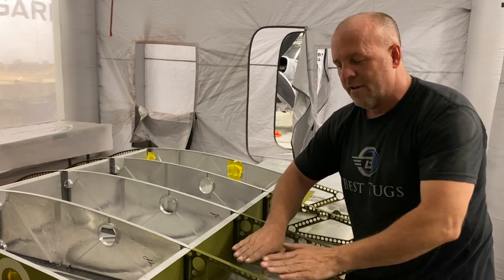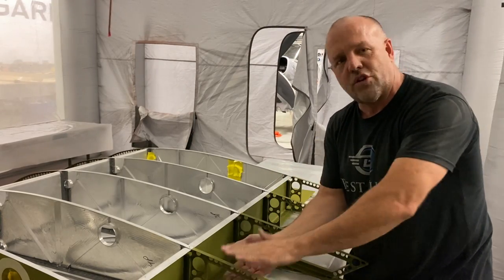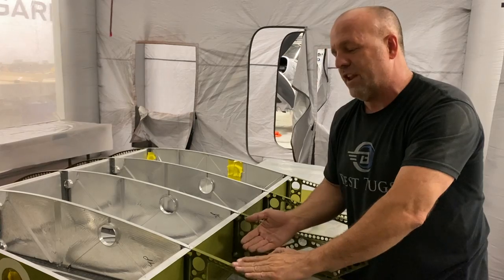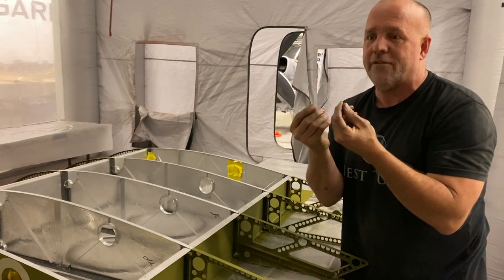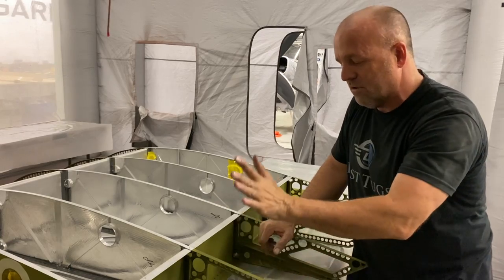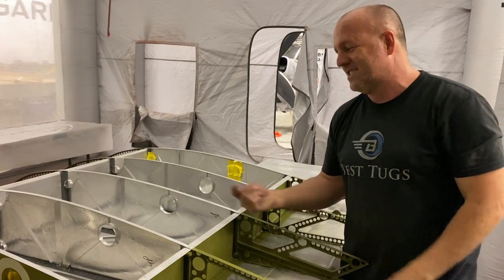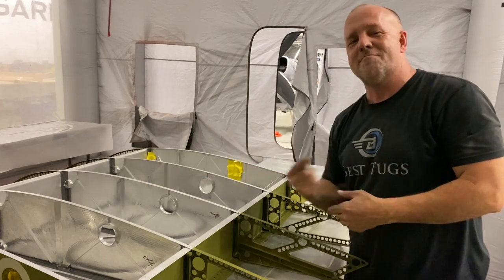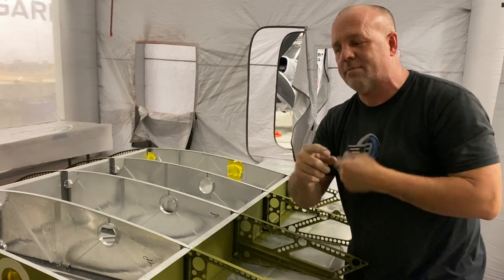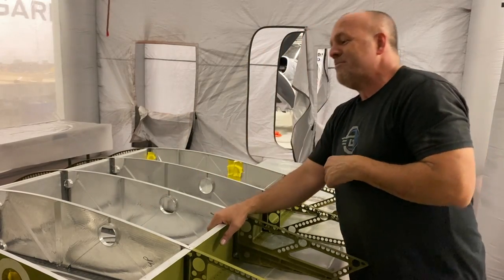I'll mask that off, paint the zinc chromate. I do want the chromate or some type of primer or bond or sealer between the aluminum, in case water does get in that joint, you have zinc chromate on both sides or some kind of a sealer. So that's the process. And then the fun part is I got to go through the holes from the bottom and put the additional layer of tank sealer on all the seams, all the rivet heads. These big holes should make it nice.